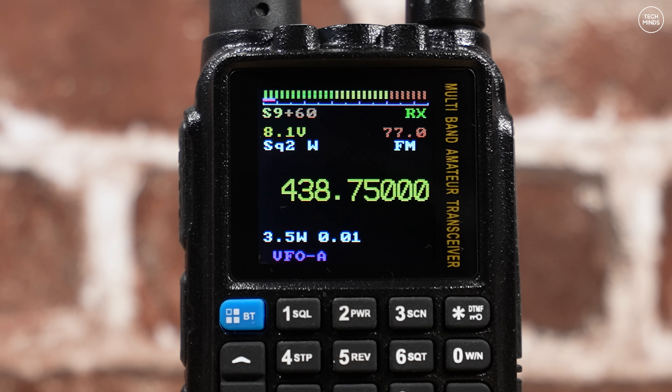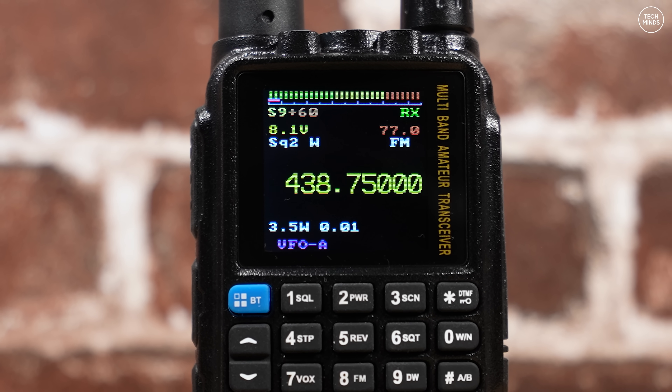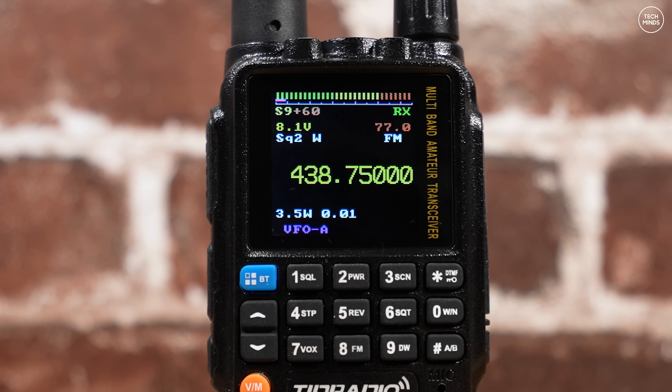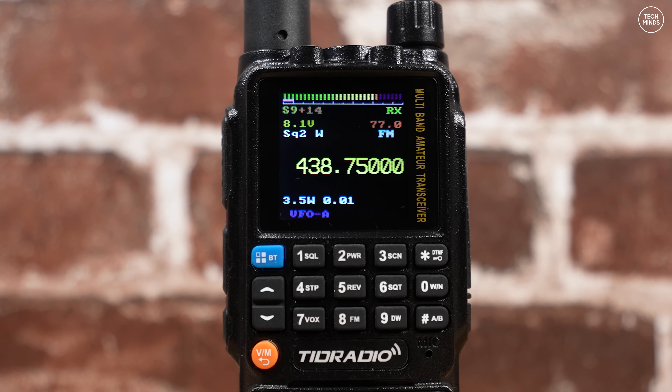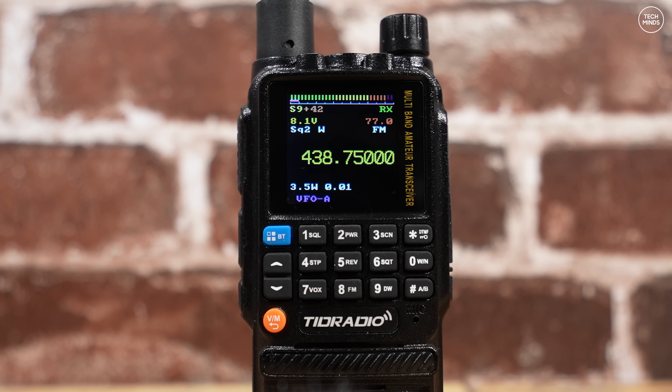You may have noticed while receiving, there's also a numeric value flickering on or off just above the FM text on the right towards the top. This is a feature you can enable in the menu settings. If the transmission you're listening to is also transmitting a subtone or CTCSS, then this custom firmware will attempt to decode this tone and show it on screen. This is super useful if you're tuned to a repeater and you don't know what the CTCSS tone is to access it — this feature allows you to quickly program your radio with the correct CTCSS tone.